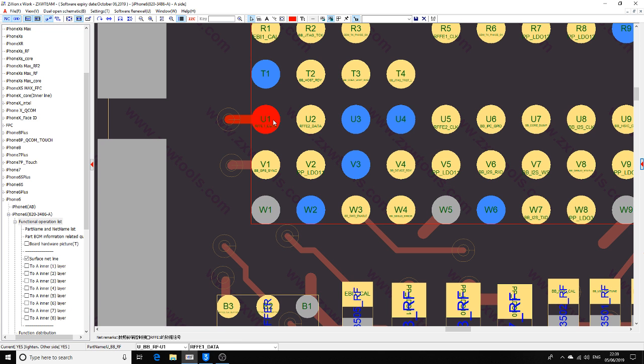So what people do, they run both jumpers because most of the time both pads are weak. So if you can see the other pad is okay, you don't need to run the second jumper. But from a warranty perspective, I always run two jumpers, because in future if the phone falls down or there is flexion on the board, that pad may break as well. So on the safe side, I run both jumpers so the customer shouldn't have a problem.